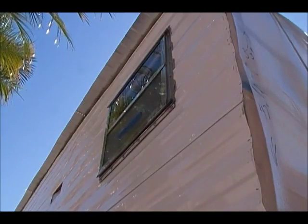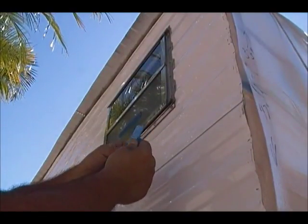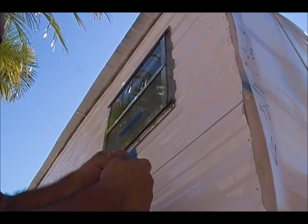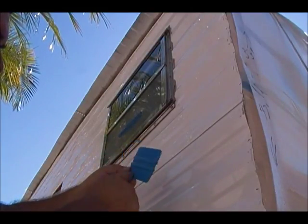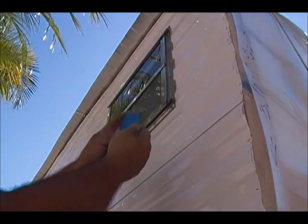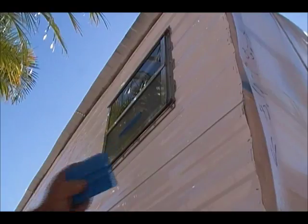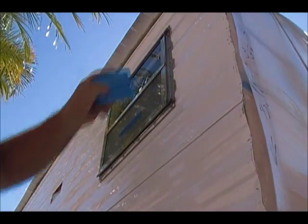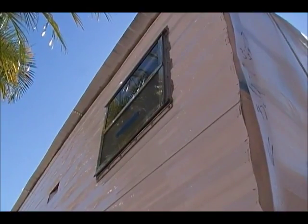The window is in and all the screws are in. What I'm going to do now is trim it. This is the tool I was telling you about — some of you may recognize it. It's a kind of spreader used to spread Bondo in the automotive industry. It's made by 3M, part number PA1. I use the shorter, slightly more rigid one — it's the same rubber material and will not scar the finish on the trailer. I'm going to zoom in so you can see a little better as I trim. There are a couple of spots I may be filling in.